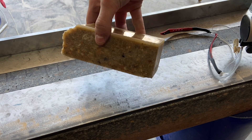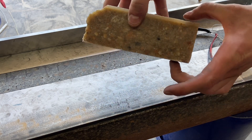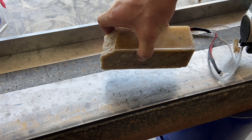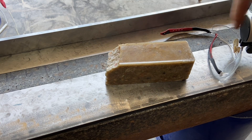I'm taking this little sample of epoxy granite to figure out what the thermal expansion coefficient is. I just got some measurements for the distance here marked by this dot with a micrometer, and took a couple of measurements to get a good reading. Then I'm going to put this in the freezer, and once it's fully cooled down, measure it again and see if we can get the thermal coefficient of expansion.